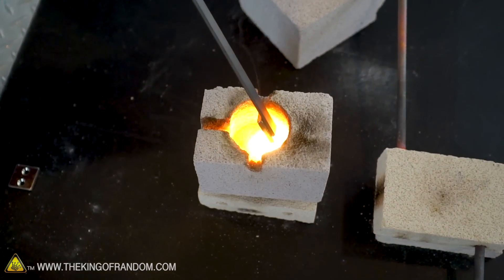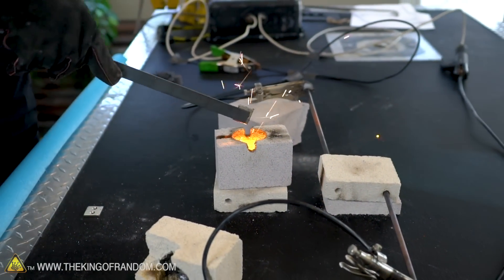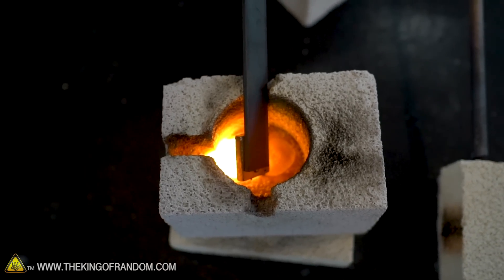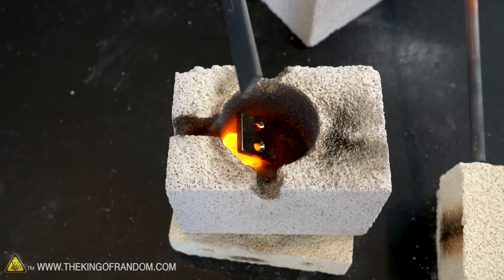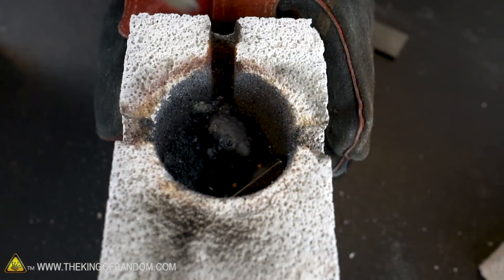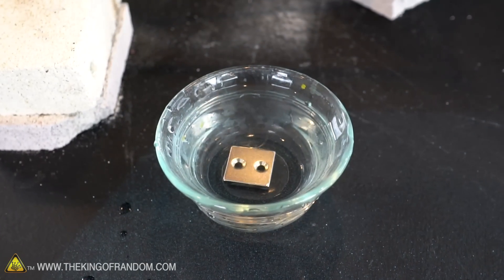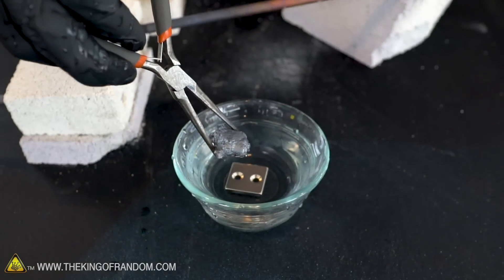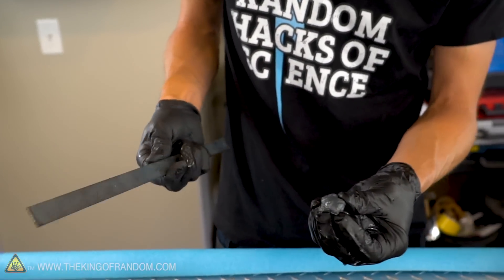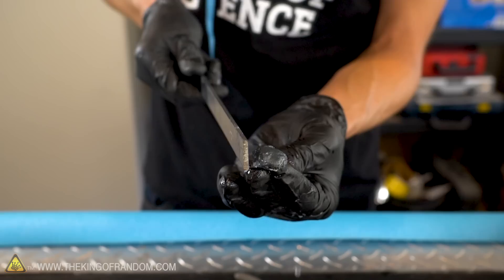The melted steel is not attracted to the magnet at all — not a big surprise. That was exciting. It's starting to cool down and I'm leaving this magnet near it, though the heat from the molten steel may ruin the magnet. My magnet just slid right off of my steel bar — I think my magnet has lost its magnetic charge. The steel has solidly attached itself to our fire brick. I'm gonna take our chunk of steel, let it cool down in the water right next to a magnet — but even cooled further in the presence of a second magnet, the steel hasn't gained any magnetic properties of its own.